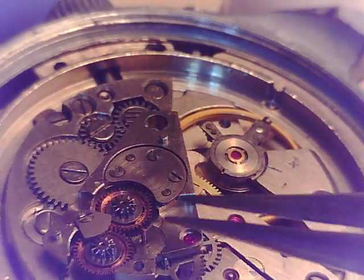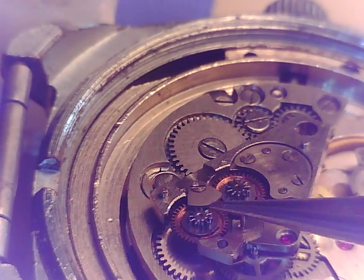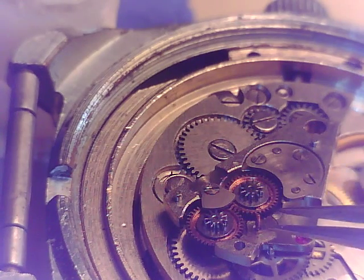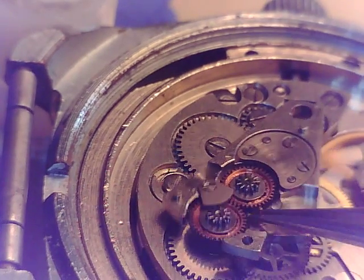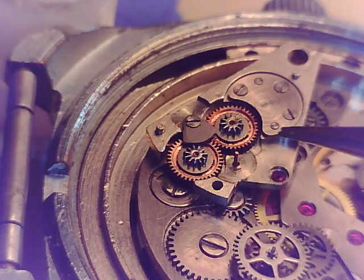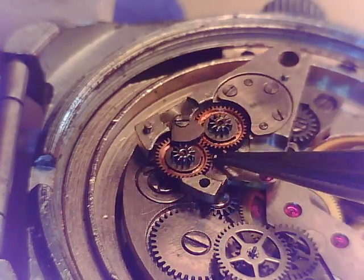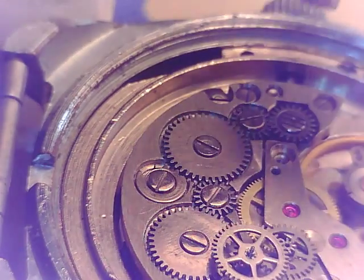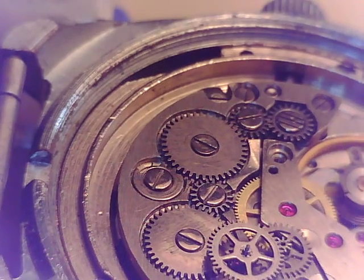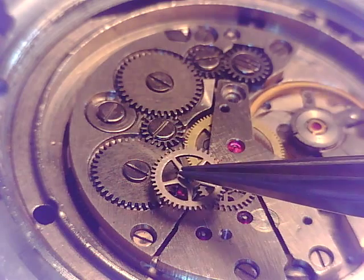Let's turn that over. There's our two one-way clutches — these allow rotation with one-way clutches on both of those. Very similar to the Vostok. This pin will be the pivot for that gear. Pretty much the same thing, but different — the same, but different. It accomplishes the same thing; it allows this to wind everything up.